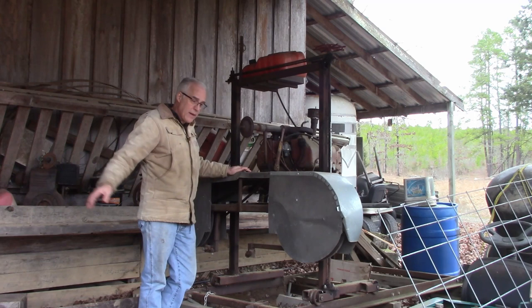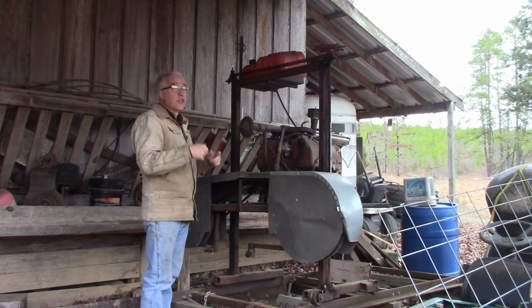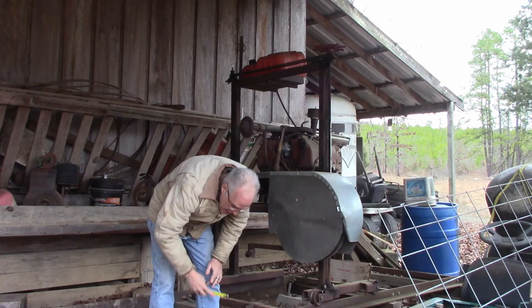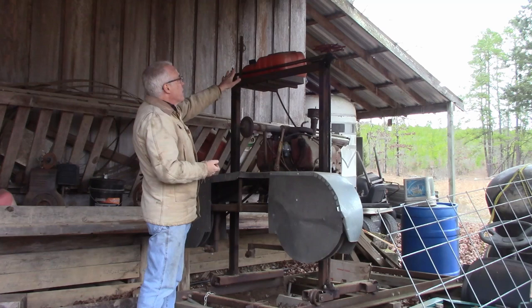This is my homemade sawmill. A few years ago I did a video on this running it and people had a lot of questions on how it was built. My son and I built it from scratch — it's got a few components we bought but basically we cobbled together a bunch of stuff. I'll link the video where I'm actually using it if you want to see it work. It's on some tracks here that are 20 feet long — looks like 3/8-inch steel, 3 inches by 3 inches, 20 feet long. Let me pull the cover off and get you in closer to see how it's made up.